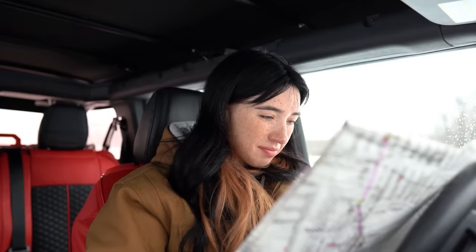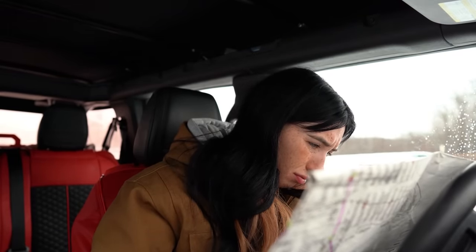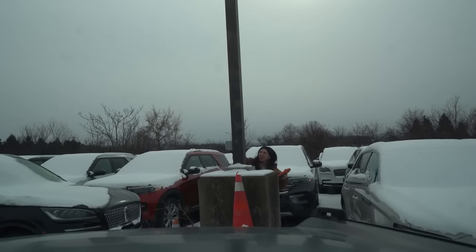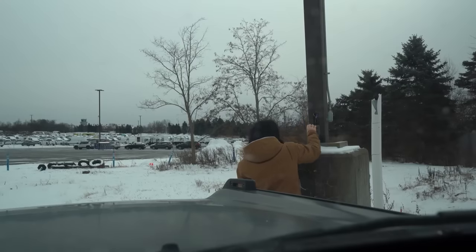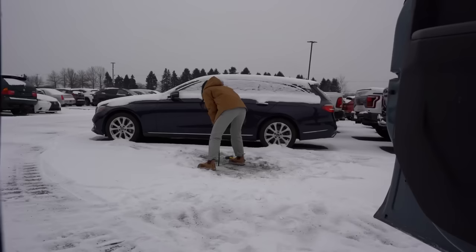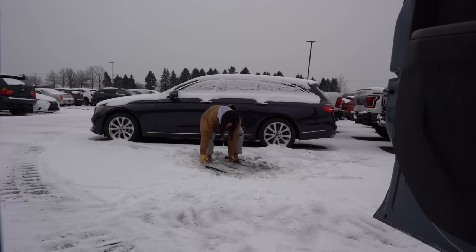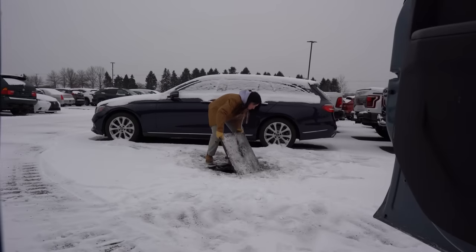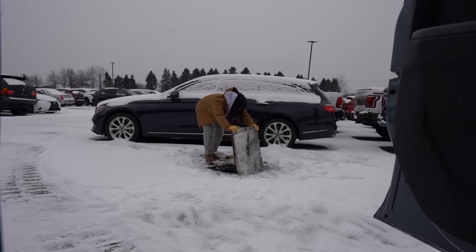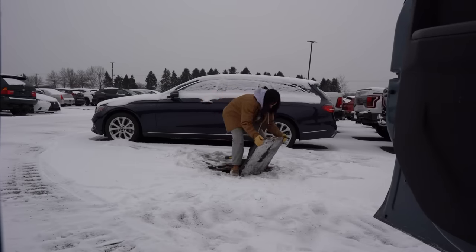There are 11 poles on one circuit — that's a lot for a two-pole 30-amp breaker. That breaker tripped out almost immediately, which means there's a break somewhere. I started opening more light poles to look for the break, then noticed way more poles were out than should have been on that breaker alone. That means there's a hot break somewhere and I really need to start tracking it down.